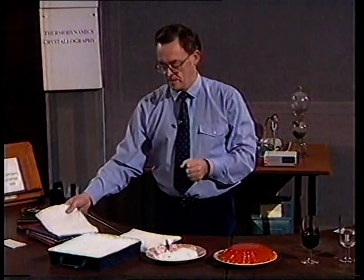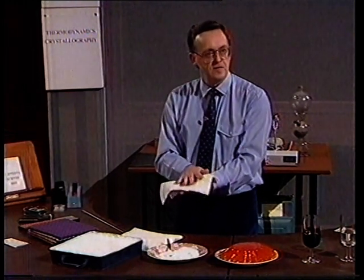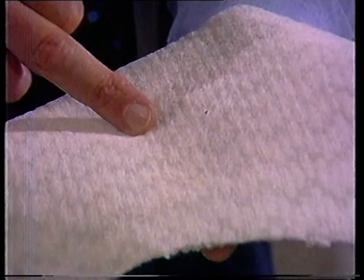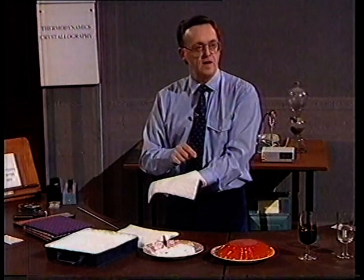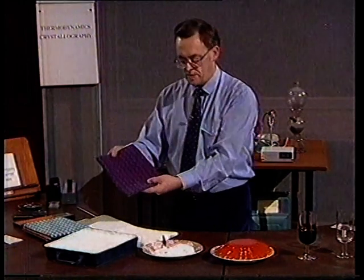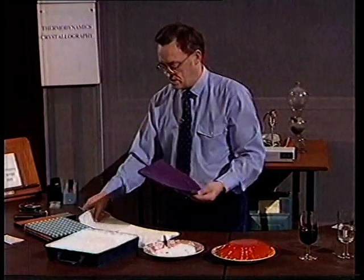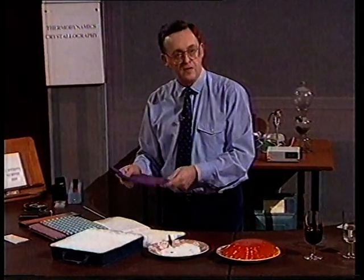Another very recent innovation is the dyeing of carpets or curtains. You can see here a rather bland-coloured set of fibres. In here, there are more than one type of fibre. One type of fibre attracts cationic dyes, another kind attracts anionic dyes. And so this means that if you put a mix of dyes into a pot — cationic, anionic — certain colours will attract to certain parts of the fibre and others to other parts. You can see here some examples where this has been dipped into black, red, and blue dye all mixed together. It really is a very, very spectacular thing — we call this differential dyeing.